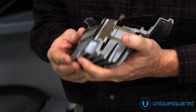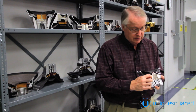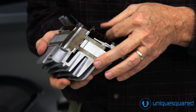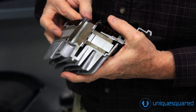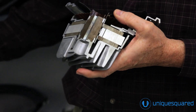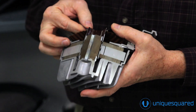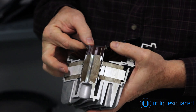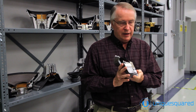This one was optimized for studio monitors so it has three shorting rings — there's one here, one here, and one right here — so there was a lot of effort in keeping distortion low. This one also, instead of having just two coils, has a third coil right here in the center, which is a braking coil. It's just shorted to itself — not wired to the outside world. But if you get too much motion and that center coil moves up into the gaps, it induces a current in the coil, dissipated as heat, which provides a braking force and keeps the cone from going farther than you want it to go. What is patented here is the combination of the shorting rings with differential drive, and there are multiple patents on this speaker.